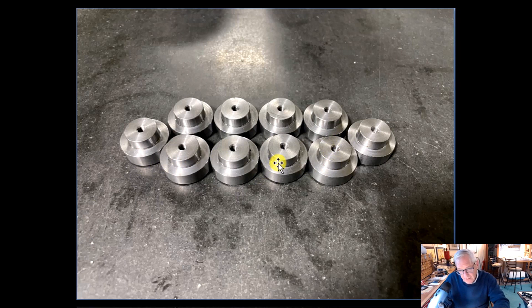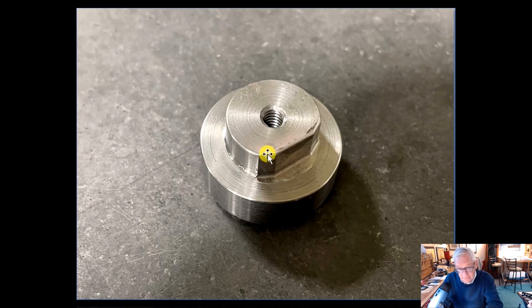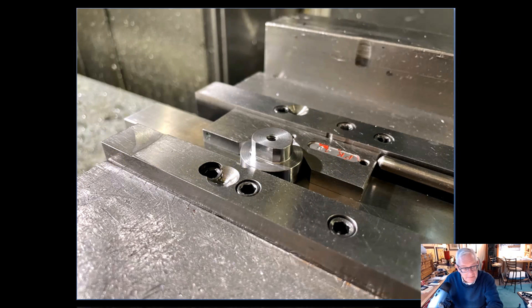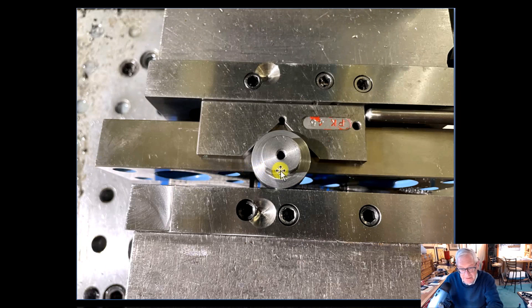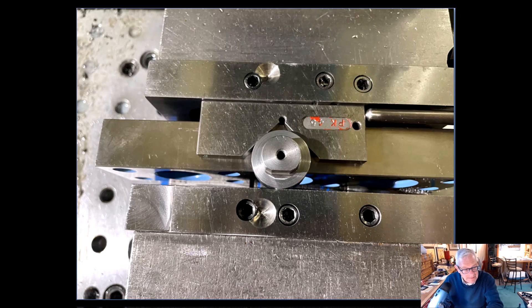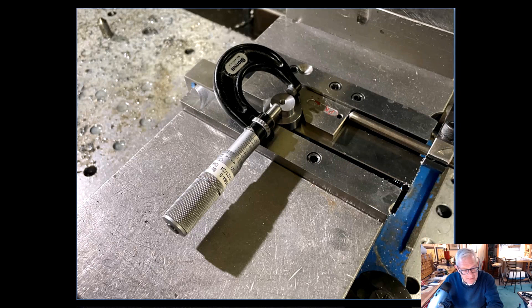That's what the plugs look like when I get them. Now I'm thinking: how am I going to hold on to these and put this flat on so I can measure it? I thought about standing it up and using the end of an end mill, but then you can't measure it. I thought about grinding them, but then they won't get a sharp corner. Here's what I came up with — I used one of my little 45-degree angle plates, set it on a parallel that happened to be the right height. I can walk right around this, put the chamfer on the flat, and now it's sticking up enough that I can measure it.